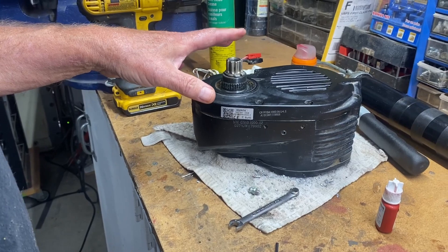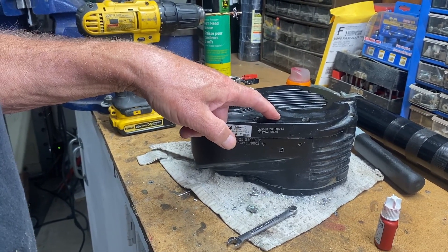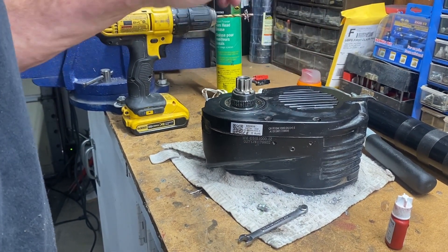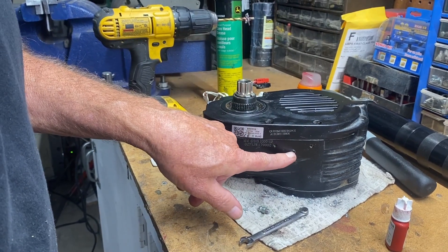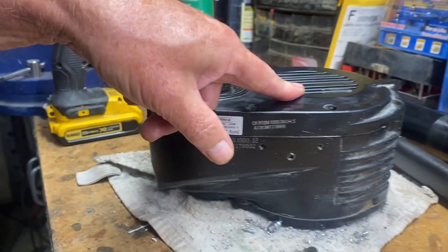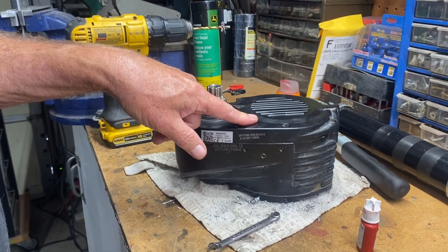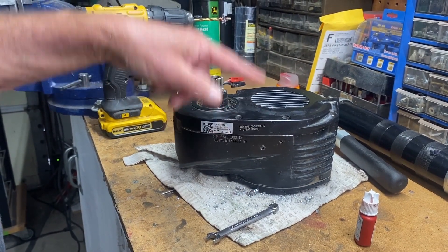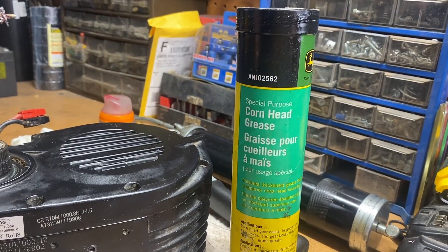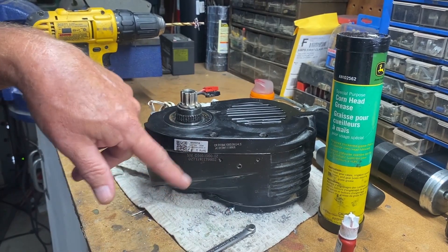In conclusion, I tried to drill the hole without dropping shavings inside, but I did get a couple of shavings in. So I still think you have to take the motor off, open it up, and grease it initially. But if it ever gets loud again, you'll be able to take that plug out, put in your grease fitting, give it a couple shots of grease, and get back to a quiet running motor. On my other motor I have 5,000 miles on it and it is silent because I used corn head grease earlier, though I did have to take it apart once to add a little more.